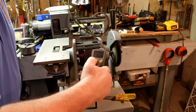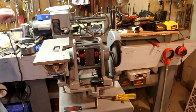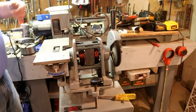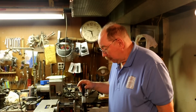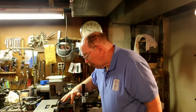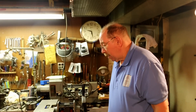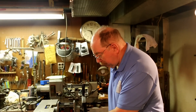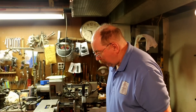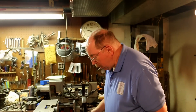The bearings are staying cool, right around room temperature. I'm hoping that my little grinder here is still in good condition. It doesn't feel hot, and checking it with the thermometer it was only running about 106. Now this isn't a fan-cooled motor — it's just convection cooling. It's got holes in the bottom of the housing and lets air flow up through, but if air can get in but not out, perhaps there's some issue there.